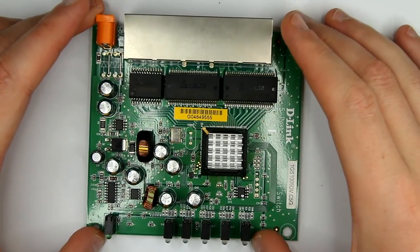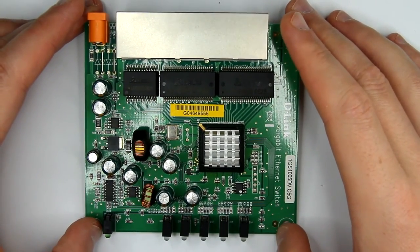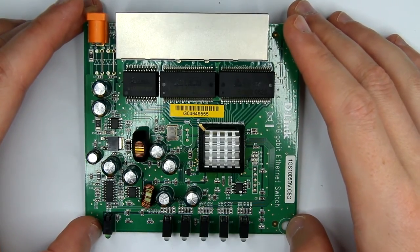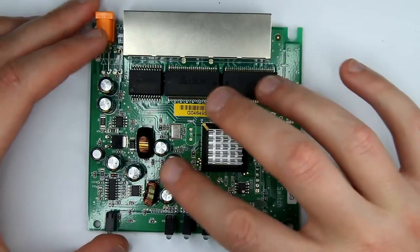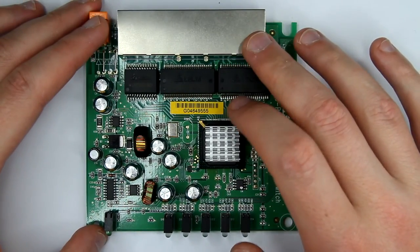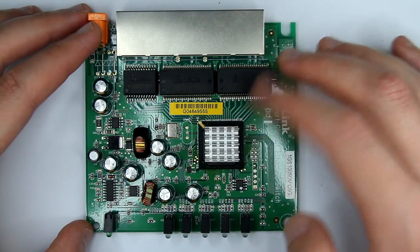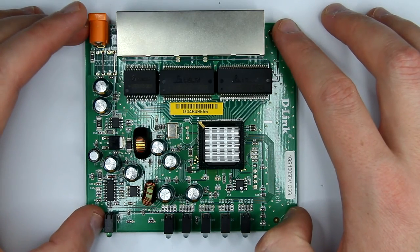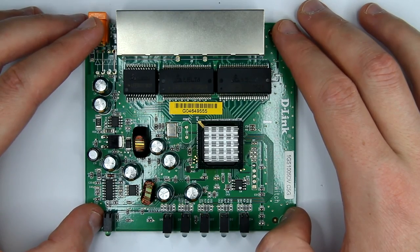So here we are, this is essentially a teardown of the D-Link DGS-1005D gigabit switch. I suspect all those 8 capacitors are dead. This is the cause of the problems with this switch. I'm not sure what else is gonzo, but capacitors definitely are. Well, I hope this video was helpful to you, and thank you for watching. Bye.